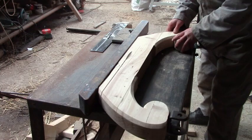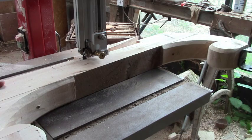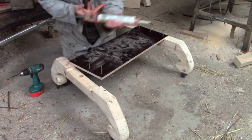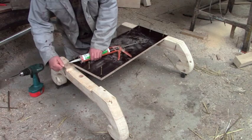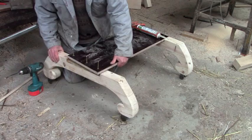The front pair have to include a turntable so the cart can go round corners, so I have to reduce their height a bit and then cut a recess for a plank of ply. I used heavy-duty exterior ply for this because it has to take a lot of twisting and pulling. It's trailer bed plywood and very expensive, but it's good stuff and probably necessary.